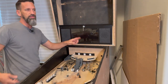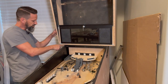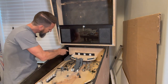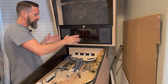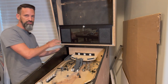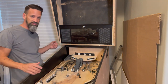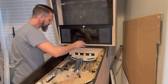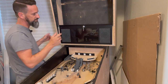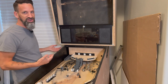I've looked around in different machines — all the modern Sterns have a little bushing, almost like a washer, to keep things from sliding and rubbing against the wood. Even older ones like my Twilight Zone have a similar small washer. I didn't see that anywhere on Pinball Life's site, but you want to make sure things are spaced just enough so the hinge is never rubbing on the wood and the artwork. I'm either going to 3D print a bushing or find a standard one online — long term I want those bushings so the side of my cabinet doesn't get scraped up.